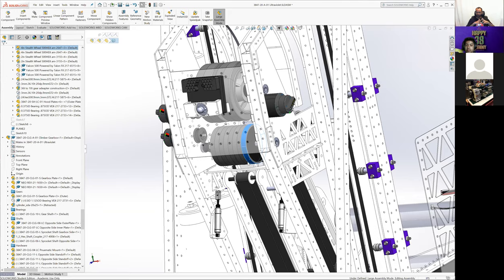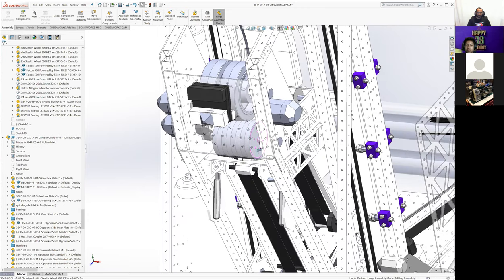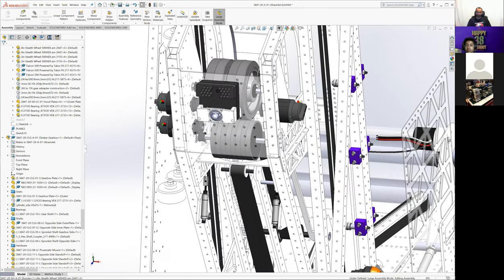So as the ball, which is moving very slowly, touches that, it's able to do the initial acceleration a little bit better than the 6-inch wheel can, since the 6-inch wheel has a larger surface speed and lower torque at the point of contact with the ball. So that's the first setup we played with, and we really didn't go away from that, right?